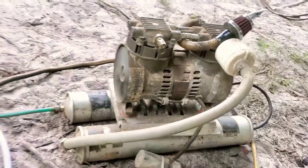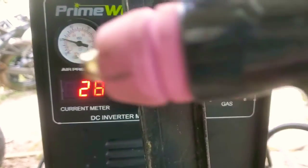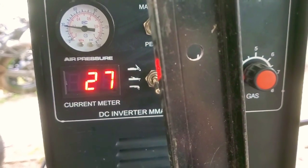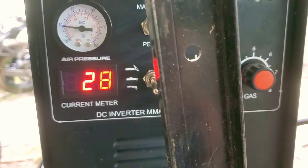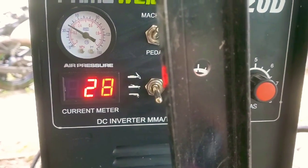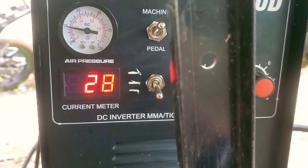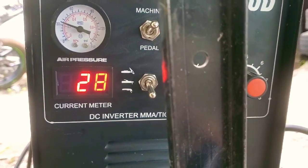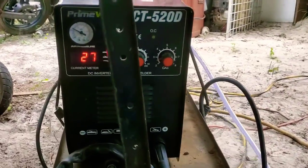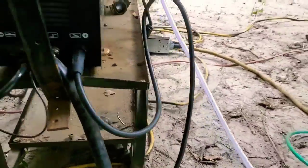As you can see, it's running. There's my pressure on the machine. I'm going to start cutting — as you can see, it holds. There's pressure coming out; it holds at around 30 PSI. And that is all you need to cut. So I can constantly cut. It slowly, slowly drops, but at some point you're going to have to stop — and watch how fast it builds right back up. But you can still cut with it like this, and immediately it jumps back up. I'll start cutting again, and you can literally continue to cut with that much pressure. It jumps up so fast — you never have to stop cutting because of the air, and you don't need a giant air compressor. It's just this little tiny thing, fits right on the bottom of this cart, so you can have it really portable.